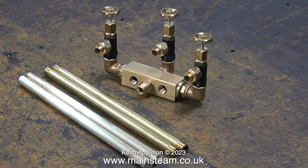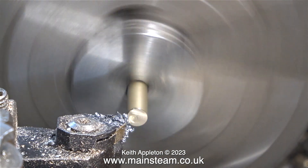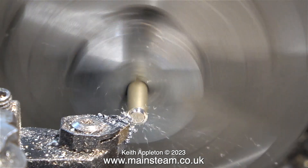I really don't want the turret to sit on tubing, so I've cut two solid pieces of brass the same length as the tubes. Over now to my Boxford lathe for the first of a few machining sequences. This clip shows me facing across the end of one of the pieces of brass bar.